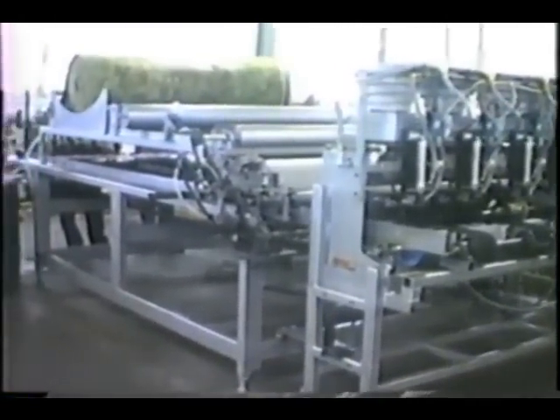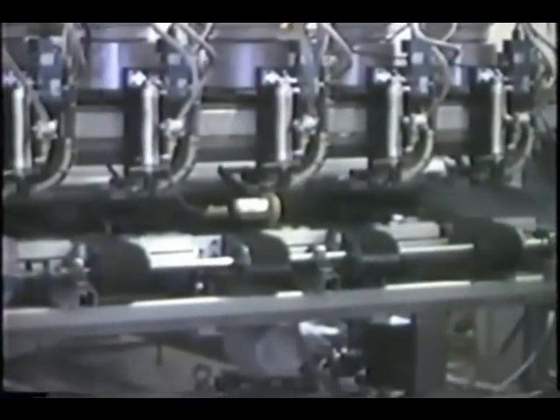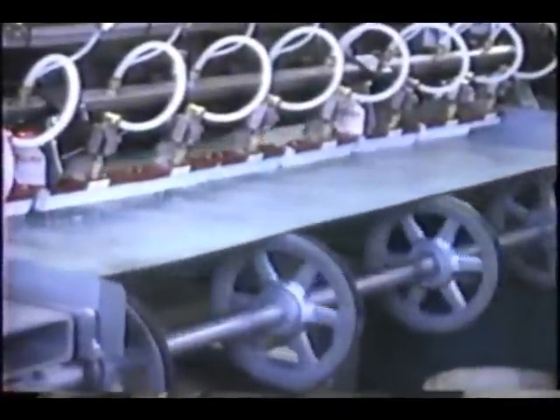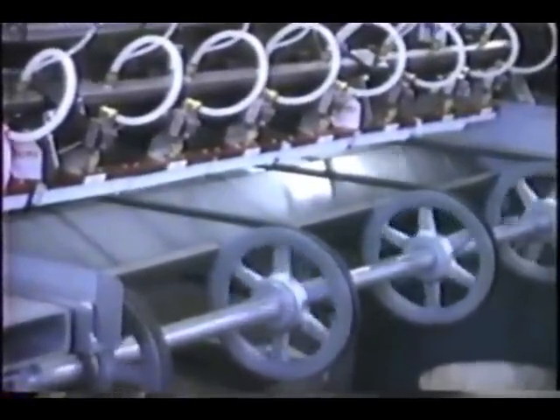The system can incorporate either a grip nail or durodyne pin spotter to final join the insulation and duct together. The adhesive system is water-based and injected directly onto the duct, producing a series of beads across the width of the material. It feeds directly from a barrel and has a water purge for ease of cleanup.